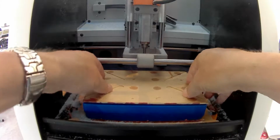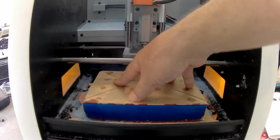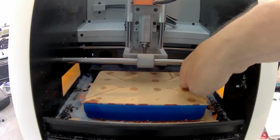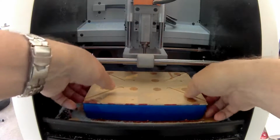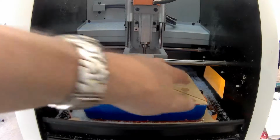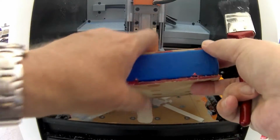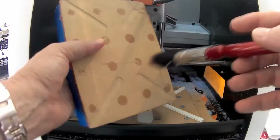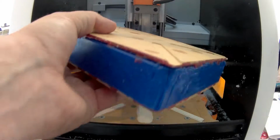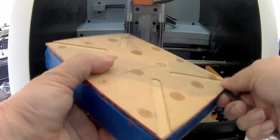After this, what we're going to have to do is take the original side base plate off. Now, it wasn't doweled on, it was just welded on there because when you originally cast the wax, there were no dowel holes and it's not possible to machine accurately to get them. So this bit of the video is showing how this piece is removed because it didn't show how it was put on there in the first place. So I just leave the old one off.